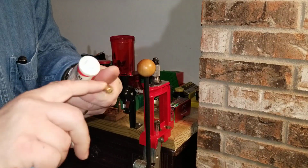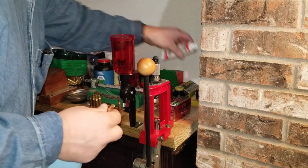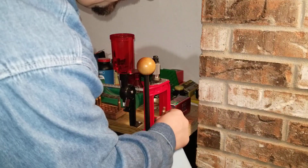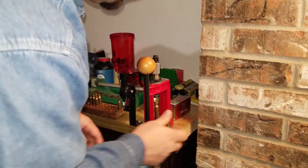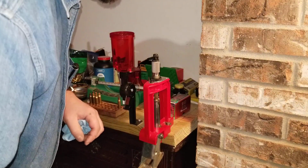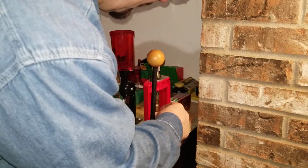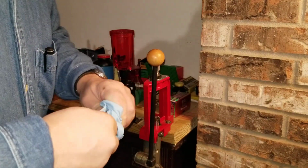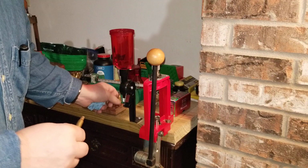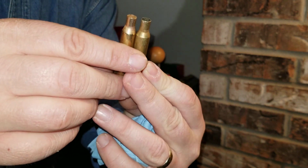I use a little bit of lead dye. I use some of that one shot, and that stuff is horrible, that spray kind. I had more stuck cases than I've ever had. But same thing, all it does is neck it up. Either one of these cases works just fine. You can actually neck down 7mm Mauser. See, now both of these are the same thing.